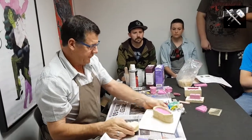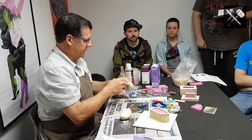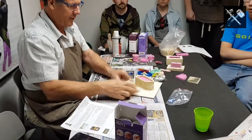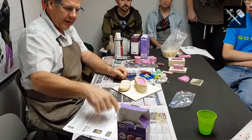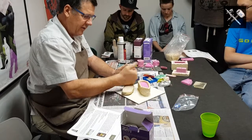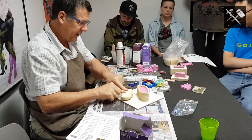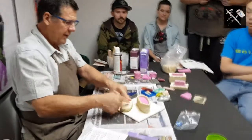So in the case of, imagine we're going to make a mould of one of these parts. What you do, and what I've done under there, you'll see it after, is I've got a clay base. If you warm this modelling clay up, it's the very top one on your sheet there, it's an oil-based clay. The more heat goes into it, the softer it gets, the easier it is to work. You put it out in the sun, put it in your pocket, in a plastic bag, not out of the bag. In your pocket.